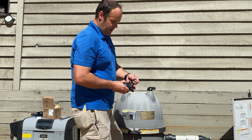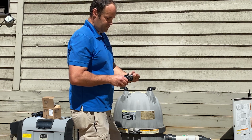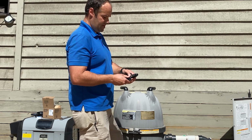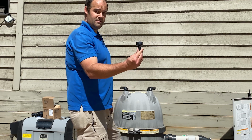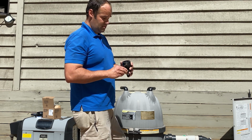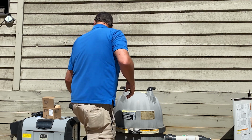These pressure gauges also have a filter bleeder valve on them, which is very handy. And they're serviceable because you can detach the actual pressure gauge from the point where it screws into the filter body. Now, we're going to go ahead and replace the whole thing because the whole thing comes in the packaging, and if we have the new parts, we're going to replace it.